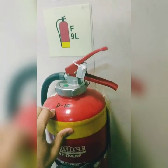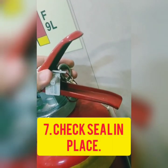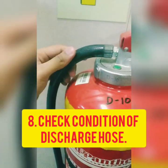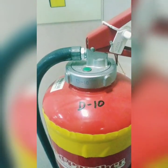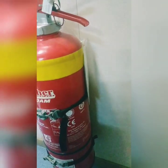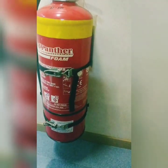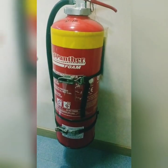In the monthly inspection you will also check this seal — it is very important. It should go around the pin so that it indicates the extinguisher has not been discharged. Then check the condition of the hose: there should be no paint marks, no cracks, no damages, and no torn areas. Finally, check the strap — its condition should be good, it should be well-mounted and secured to the cradle, not moving, and the extinguisher should be strapped in such a way that it can be removed quickly in an emergency.